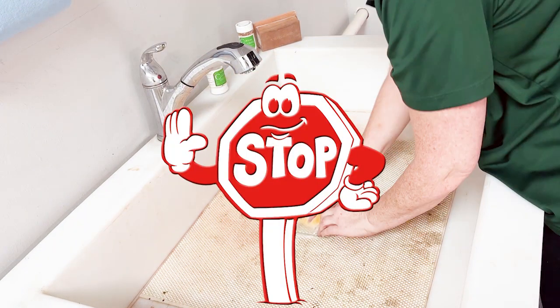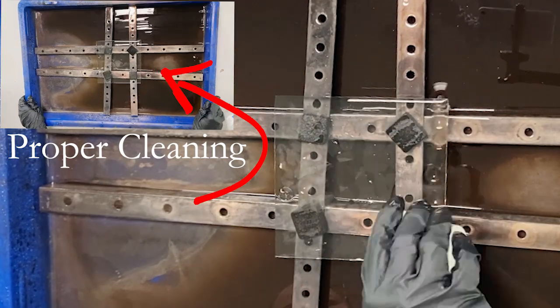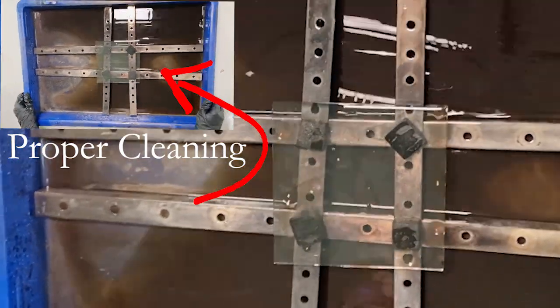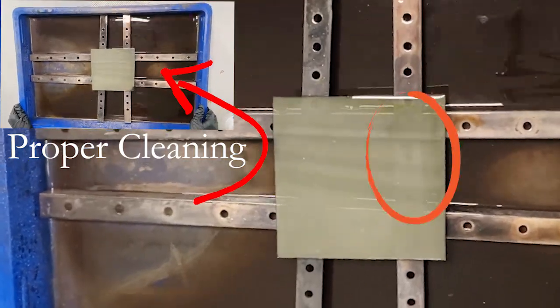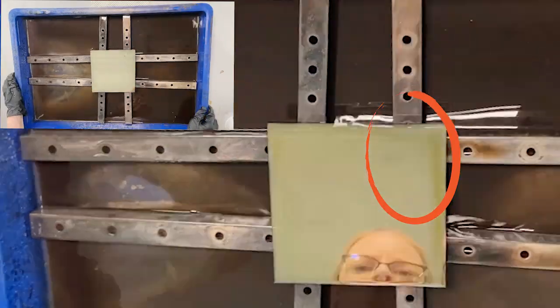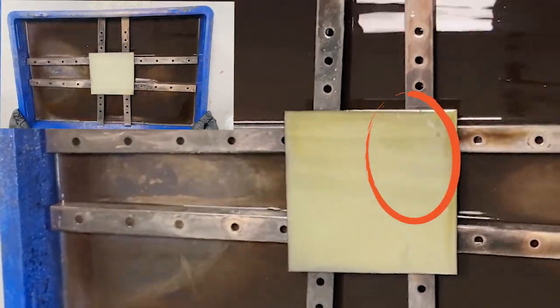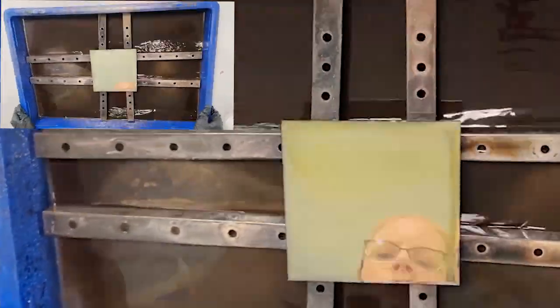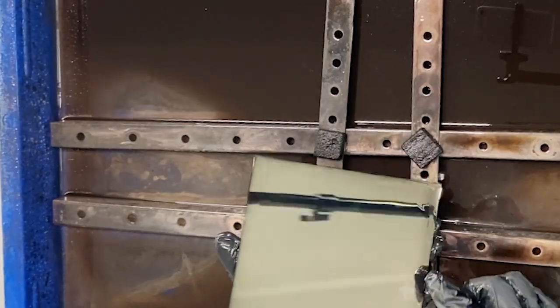First we're cleaning our piece. Nope, stop. Did you see our hands? No gloves. And that cleaning was not thorough. You must wear gloves to avoid the oils from your hands depositing on the piece. Let's see how that mirror develops without the proper cleaning. You can see a good example in the upper left hand corner. Note that in our bad mirror here you can see the silver isn't depositing evenly at this edge and sediment is building up.